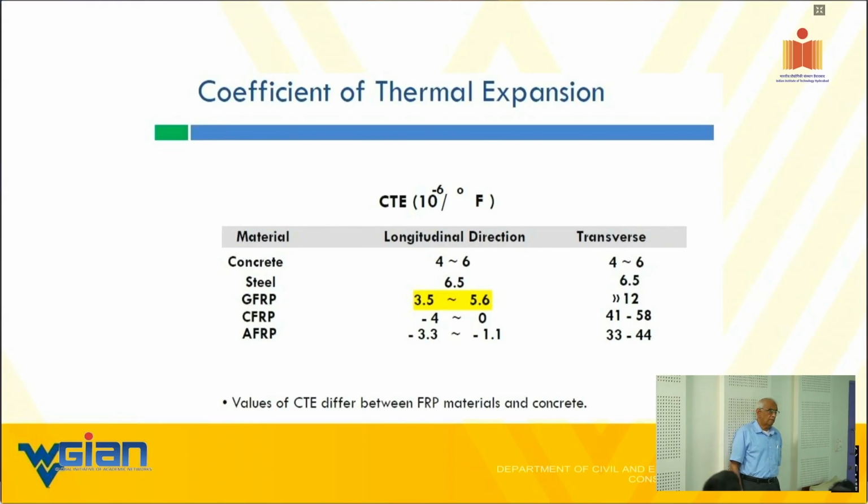Okay, remember, what did I say? Bending type shear, which is what is known as interlaminar shear, is about 20-22 KSI. Whereas the in-plane shear, meaning like this, single shear, double shear type, is only 4.55 KSI. Why? That is primarily dependent upon the resin, whereas the bending type shear is resin plus fiber, primarily the fiber effect. Of course you have resin effect too, no doubt. If you look at your VQ over IT shear diagram, you can tell pretty much what I'm talking about. You see? The complementary shear is the one that's going to drive the magnitude of interlaminar shear.